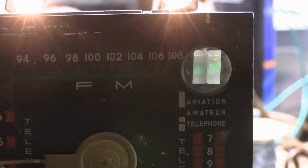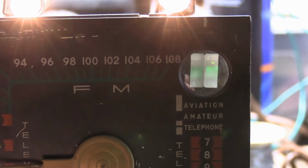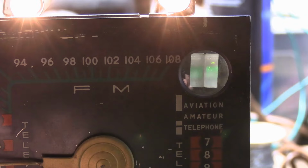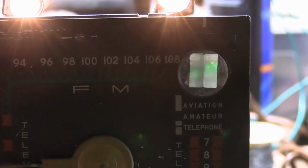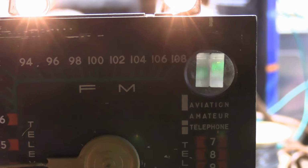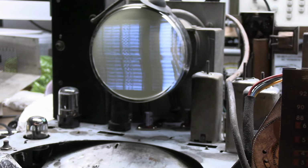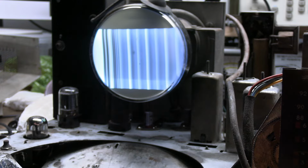So why do I say it's gimmicky? Well, this type of eye tube in particular, I think only one side of it moves when you're tuning a channel. Yeah, just the right side. The left side never does anything. And the right side, it's split in half, only the top half. So only the top half of one side does anything. And that's about all it does. Just a very tiny level indicator. But you know what? It's a really good indicator, too, if you're tuned in or not. Just look at the screen. Okay, there we are not tuned in. There we are tuned in. But I know people like their eye tubes, so...